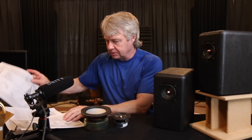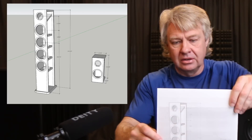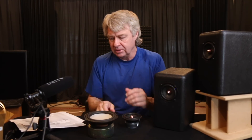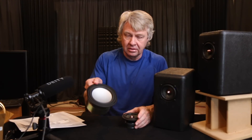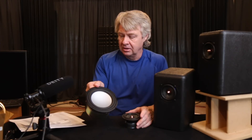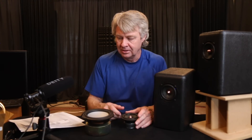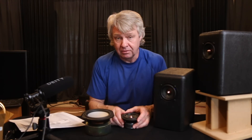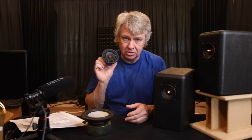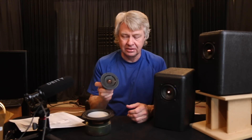We've got a floor standing version that we're going to do as well. It's going to have one LGK driver up top and four of these little five-inch drivers in a line down below. The sensitivity is going to be a lot higher on the four five-inch drivers, so I'll use a larger coil to start the roll-off back where these are already rolling off, and fold that down to match the sensitivity of the LGK. Even though these are in a sealed box kept really small — and these don't need much airspace — the overall extension is going to be pretty good as it's brought down to the sensitivity level of the little LGK driver. It'll make for a really interesting little floor standing speaker with good bass, good control, and still have the beautiful vocals and detail that these little drivers have.